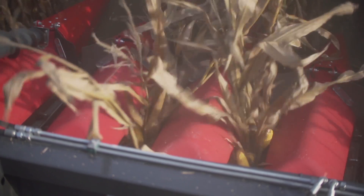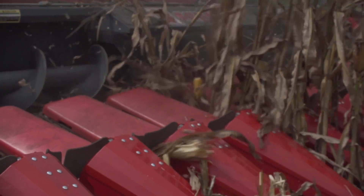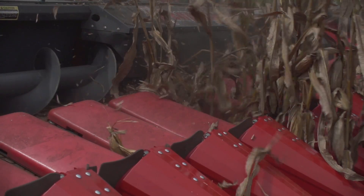From here, let's go to Jason Gayheimer — he was the guy running the combine. Let's get his perspective on how things look from the cab. I was very impressed with how the head feeds the corn in. One of the things I noticed: if you get the head a little too low, it tends to do a little more pushing than bringing the corn in. So when you're keeping the snout six inches to a foot off the ground, it does a really nice job of feeding the corn in.